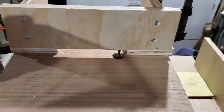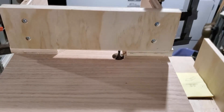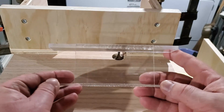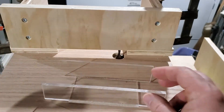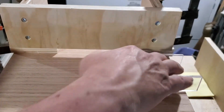It works, but I think this router bit is too old and definitely not sharp enough for acrylic — I'm going to pick up another one and give that a try. This is way too much material being removed, so I took the time to adjust everything to get it just ever so slightly over the surface. After running the test piece through, it's fine, but the bit does need to be sharper. I'm not going to inflict any more of these tests on you, but you will get to see this being used.